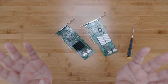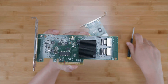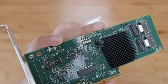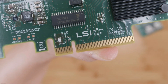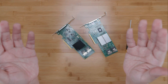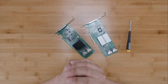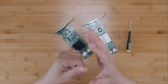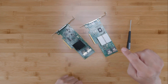Lastly, the sixth thing you need to know is that LSI controllers have a fragile SMD fuse. If you look closely on the PCI connector there's a fuse labeled F1. This fuse has a tendency to fail. Although it's not a very high failure rate — I've only seen it happen a few dozen times after selling over 30,000 controllers — it has become noticeable over the years. In fact, many of the B-Stock cards I've repaired were ones where I had to replace that F1 fuse. In contrast, I've never seen that failure on a Dell H310.